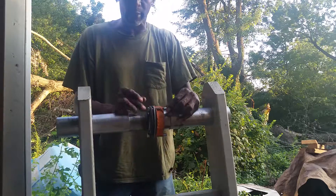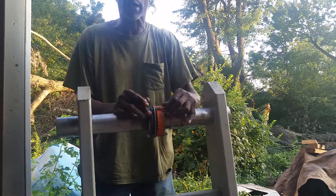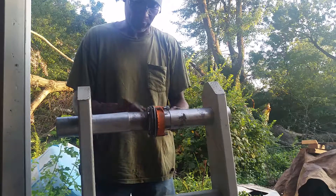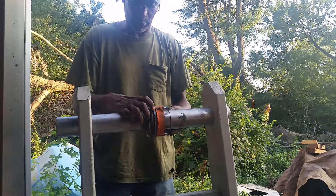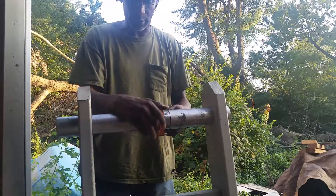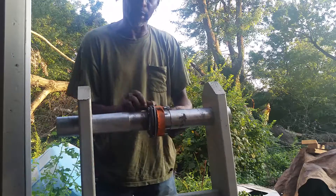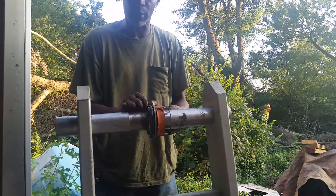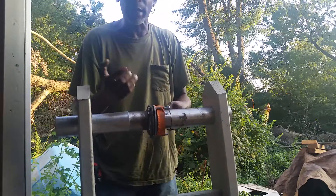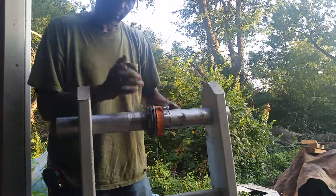Assuming that the old flange is flat — well, if it's not flat, we have to flatten it. We may have to shim in between the two flanges with some washers and bolt it in, and then use a pair of heavy-duty pliers and squeeze right where the gap is until you flatten out that flange. We also may have to use a torch or a hammer, but that gets complicated.